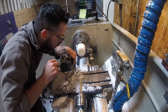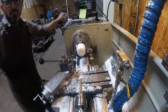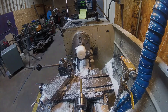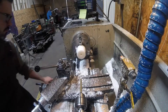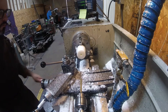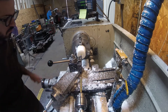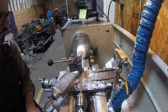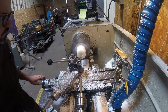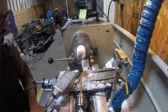I'll drill this out until the flutes disappear, then peck more often because the chips load up inside the flutes. Then I'll switch to a half-inch brass solid round rod that I'll use to catch the part when I part it off. Now I switch to do the ID 30-degree taper. I'll include a photo of how I indicated the compound in — I just set it to 30 degrees and checked it with an indicated method on a 30-degree center, which was pretty close. I also made a little yoke attachment for a Milwaukee drill so I don't have to turn the compound by hand.